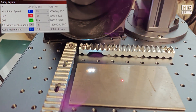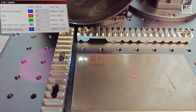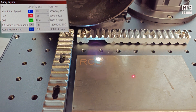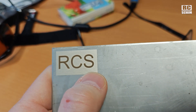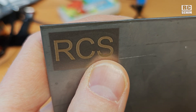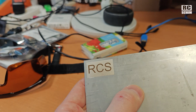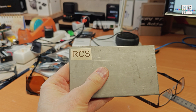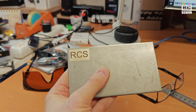For the steel marking I did a clean pass which looks really nice — with 180,000mm/min and 30% power. And now with about a tenth of the speed I will try the steel marking. I was really impressed by the clean-up path, and the slower or different speed setting really gives a good contrast image. So maybe it's enough to just use the slower settings for your markings on steel. I wish I could cut it, but you'd need a plasma cutter for this kind of steel.